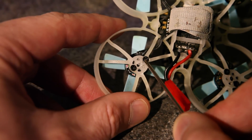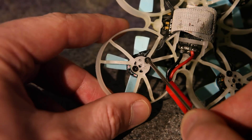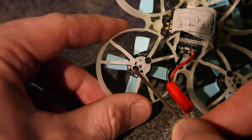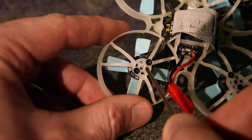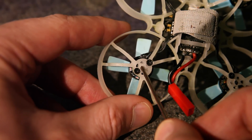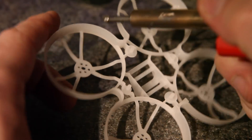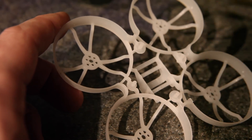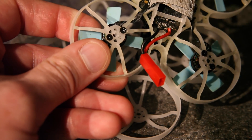What I did is I put two screws in each - just two seems to be enough. And this one, I had to drill right through the frame; there's not normally a hole there. This one there is a hole, but it's not quite enough separation, so I had to kind of dremel it out. This one is actually getting pretty close to the side of the material, but not quite breaking through, and those two screws are holding it. Now, when you do this, the shaft will actually rub on the plastic. You can't have that - it's got to be able to spin freely, and the C-clip has to be able to move around freely. So what I did is I took a blunt, old soldering iron and melted away a cavity on the top side of these wheel wells so that the plastic would shrink back a little bit. Then you can spin the motors. You want to see that C-clip spinning freely.